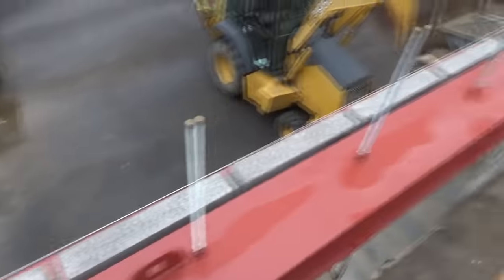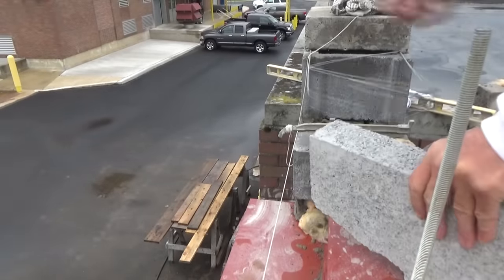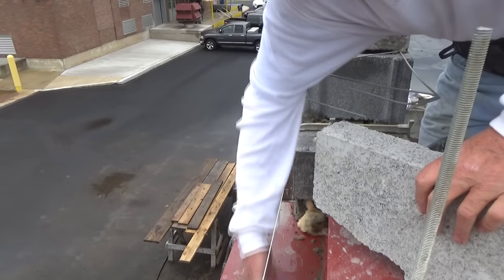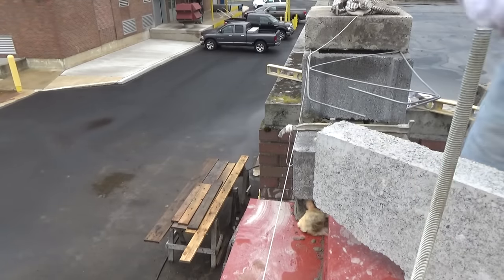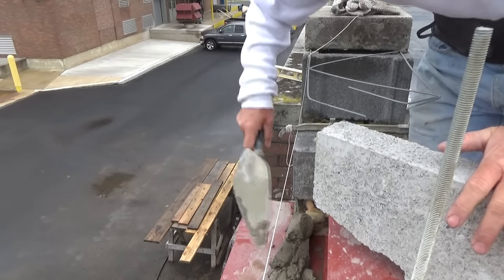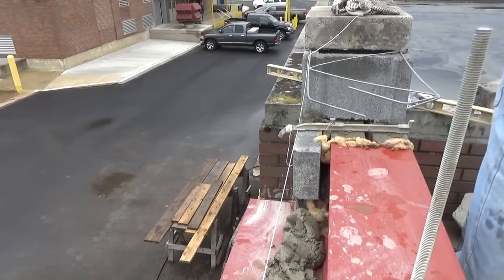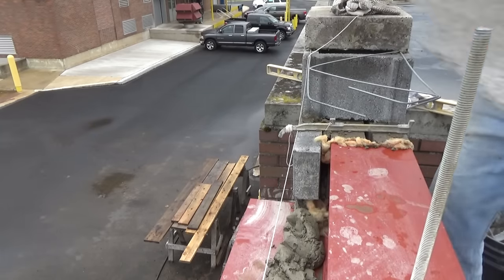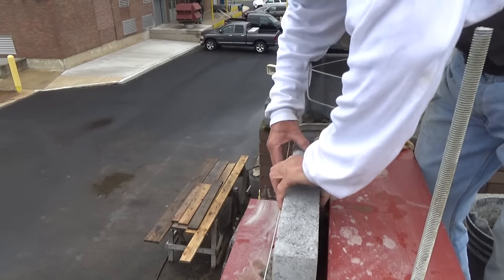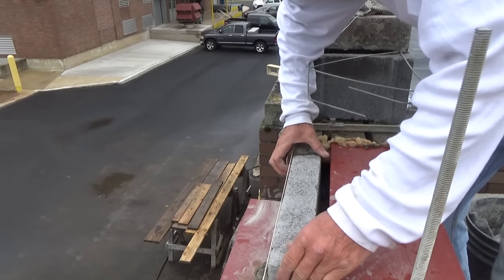Now I'm gonna put them in. Here's my three-inch cap, and here's the bolt — I don't want the cap touching that bolt. The concrete is gonna slide across here; I'm not worried about that, I just don't want it touching that bolt. I don't want it touching that bolt at the ends — in the middle I don't care. I'm gonna get it right down in there. That's my first block.